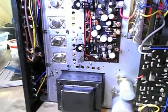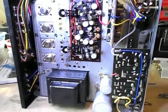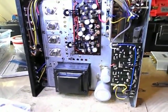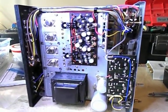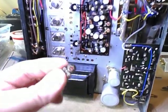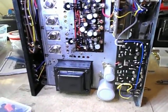This is the 41st KA-2000 I've restored — I keep track of them in my business records. This is a big issue. I was just reading a blog tutorial about restoring this amp where they put Nichicon Gold caps in and did a number of things, put in some really high-quality components — and they left these crummy bias pots.